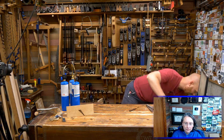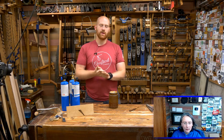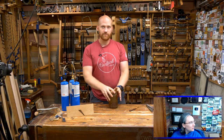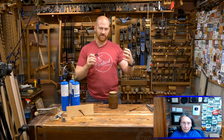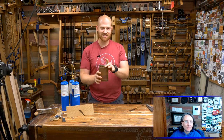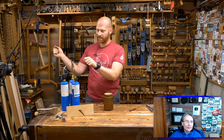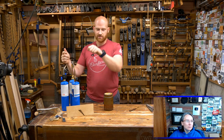Basically what I have is a metal jar about the size of my boiled linseed oil jar, and it's full of used motor oil — the black motor oil. Now it's not the best thing to use and there are lots of other people who will tell you specific oils to use in specific ways. I use a metal jar, not a glass jar, because you'll heat things up and there's a chance of breaking the glass, and you have hot metal and flammable oil spilling all over your bench — no glass jars. So you're going to get your oil container out and ready, turn on your torches, heat it up, have a way of putting a magnet on there to test it, and as soon as the magnet doesn't stick, you dunk it until it cools down all the way.